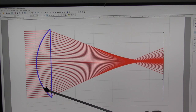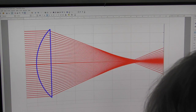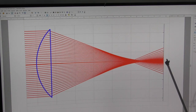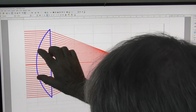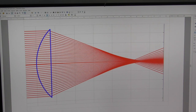All lenses you're likely to come across are what they call spherical geometry - this is part of a sphere. Every lens, no matter its shape, has got this central piece. As a lens becomes longer in its focal length it becomes less curved, so less curvature means longer focal length. But the less curvature also means more flatness at the center of the lens, because this flattish section becomes even wider as the lens becomes flatter. That's an interesting property I didn't originally understand until I started working with my RF machine.